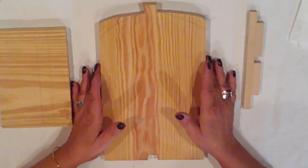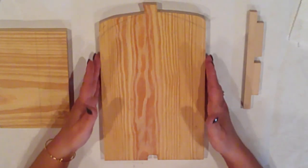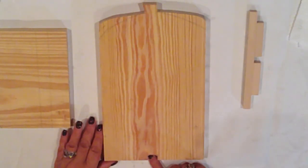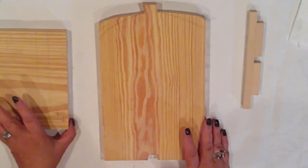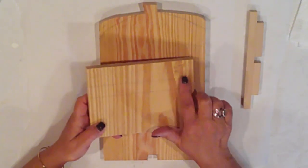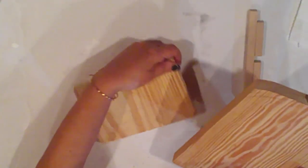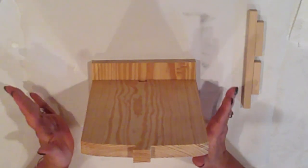I had a 16 by 7½ inch plank of wood. I cut it into two pieces, and I cut the 11-inch piece to look like a pumpkin by basically slightly rounding the edges and notching a small stem. I also cut a small notch at the bottom to accommodate the wire of my electric candle. The 5-inch piece will be my base. I've drawn a line where my pumpkin will sit on the base, leaving enough space in the front for the candle and in the back for my brackets. It'll sit just like this.